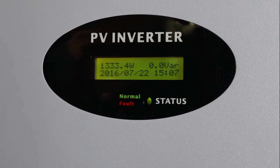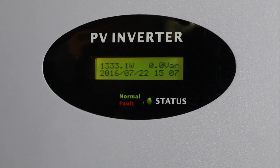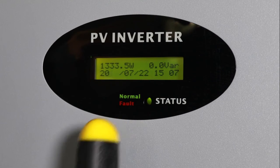2.5K to 5.5K MTL-S series inverters integrate a clock for time display. It is suggested to set the inverter date and time correctly. E-today may be cleared and accumulated from 0 again in the daytime if the inverter time is incorrect.